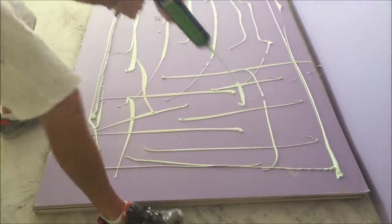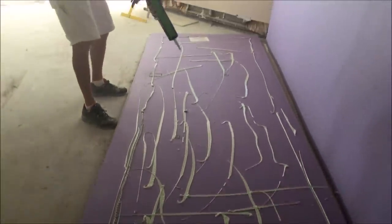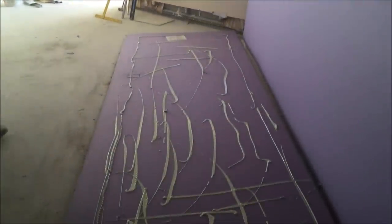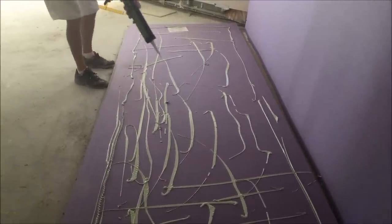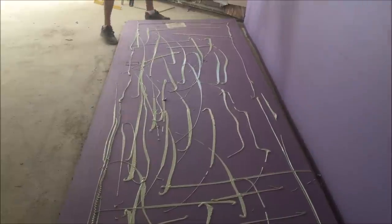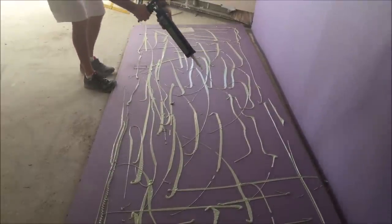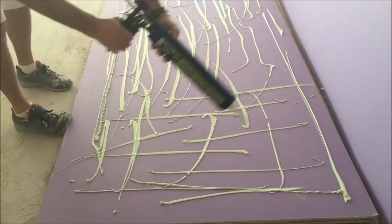You can use up to three tubes per sheet, but they recommend that's the highest you want to go. I'm doing two tubes on the sound break drywall which is four foot by twelve feet long. The tubes are a little bigger than a regular size tube of caulk, so you do have to get the larger caulk gun as well. There is a slight odor with the green glue products and it takes a couple days for that to go away — kind of like paint. To get the maximum soundproofing, allow 30 days to dry.